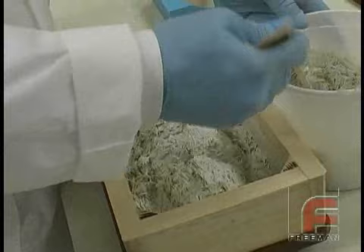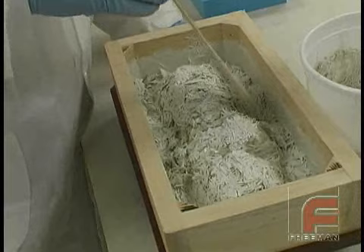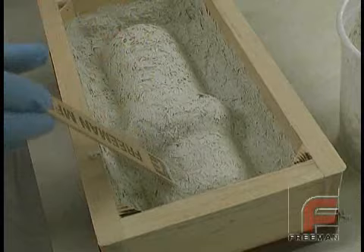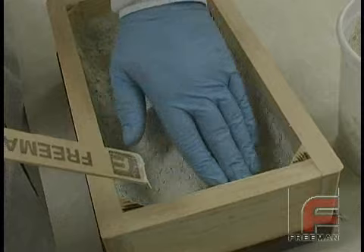As we progress, it may be difficult to see exactly how thick our tool is. We want 3 sixteenths to about a quarter of an inch thick. Notice how much easier it is to apply this thick of material than if we were using numerous layers of fiberglass cloth. This is one of the primary advantages of Repro Surface Coat and Laminating Resin. As our mixture starts to dry, it is even easier to work with — we can even form it with our hand.